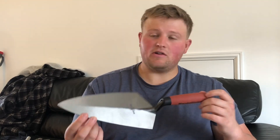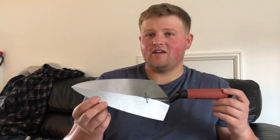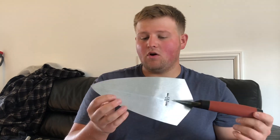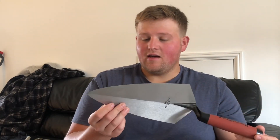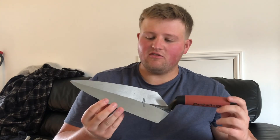That's the whole point of having a big trowel for traditional method, which is really effective. If you get really good at doing the traditional method fast, you can easily lay as many bricks as with pick and dip, but it takes a lot more perfecting and a lot more hand movement. I'm going to go over the reasons why I'm going to start using the 11-inch trowel.